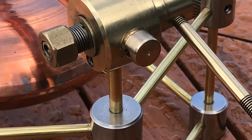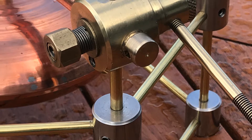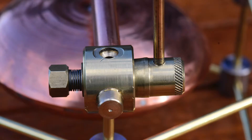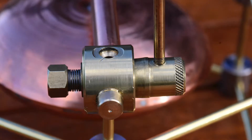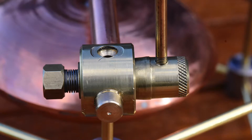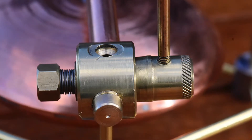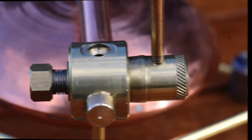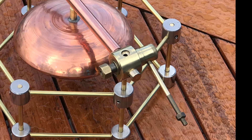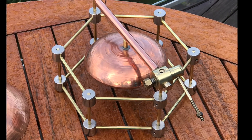This stopcock is simply a bored hole in the outside part of the brass fitting, which is a tapered bore hole at an angle of 5 degrees, and then the plug is made separately with an angle of 5 degrees as well. A horizontal bar was screwed into the end of the tapered plug as a lever to turn it around, and the other end was turned down to 10 millimeters and a die used to thread it with a handmade nut to fit it, plus a spring to hold the plug firmly in its taper. To make sure it fitted properly I had to lap it in, which means putting grinding compound onto the two parts, putting them together, and turning it around in the lathe for quite a while so that one piece grinds into the other so they exactly match.